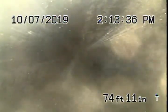We're here at 725 Burley Drive in Pasadena, inspecting the sewer line. There is a clean-out where the pipe exits the house on the right-hand side. We chose to go through the roof vent because we wanted to check the main line underneath the house, and everything we've been able to see so far is ABS plastic.